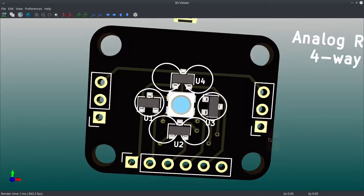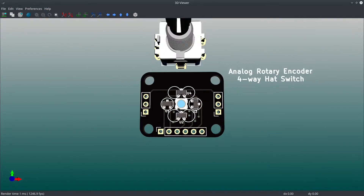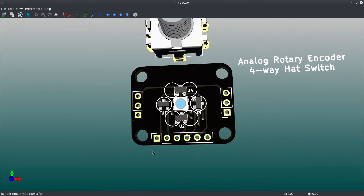Putting the little chips on a board like this is pretty easy compared to writing the code that can turn analog signals into rotary encoder motion. Fortunately I've already figured that out. What I haven't figured out is the tilt code — forward, backwards, left, right. But we've got LED in and LED out, so you could daisy-chain them together. There are four signal pins for the analog controls, and the rest is just power.